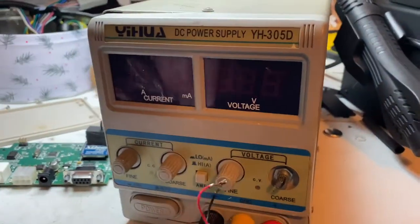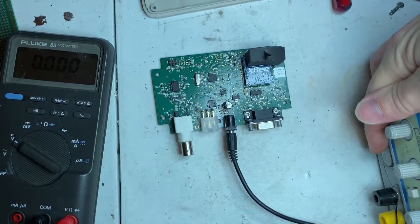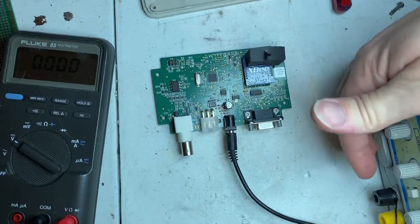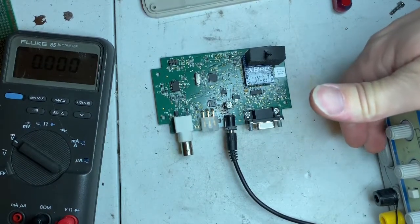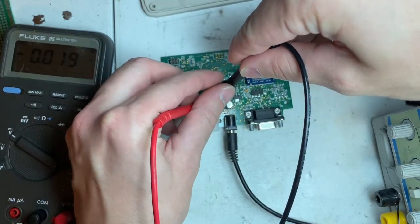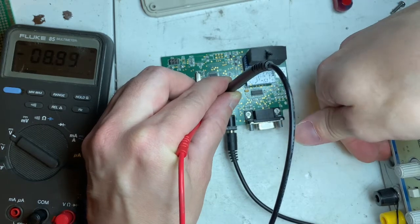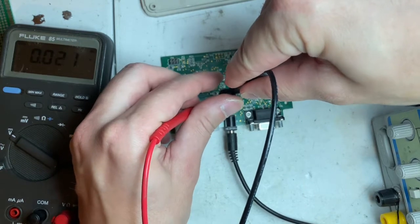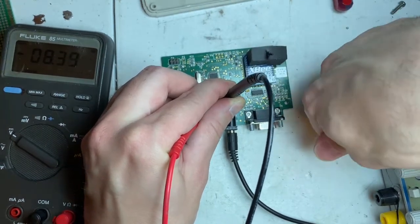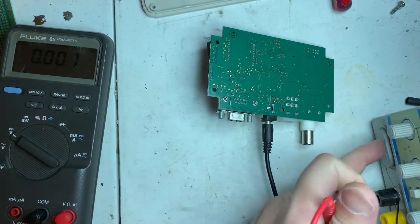We're just going to tie these wires right onto that and clip it in, see what happens. Okay, we're going to fire it up. I don't see no green LED. It's not drawing any current either, so that makes me curious. We'll get some voltage readings from the regulator here. It's getting where it should be, about. May not be the best choice for the filter capacitor. I may have to crank it up just a hair for 9 volts.